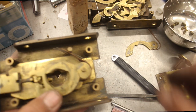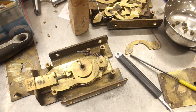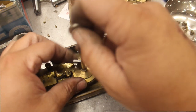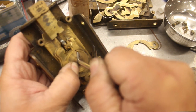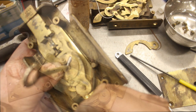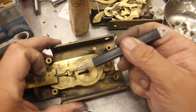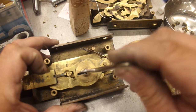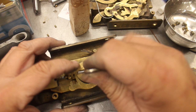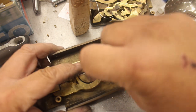Lever six, third or fourth cut — I had to adjust by hand and I think we're getting somewhere. That looks good. Lucky last lever doesn't mean we're done — just means we're getting closer, there's going to be a lot of adjusting and recalibrating afterwards. Seventh lever, first cut. Of course we've got a little burr on the back of the key again. Pop that key in, go all the way, let's see if we can center it — we're still too high. Seventh lever, second cut. When you look at this you have to imagine it used to have a little leg that came down, making the tolerance about this much — now that leg's been removed there'll be quite a large amount of tolerance.